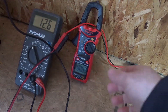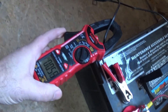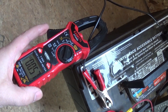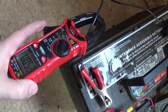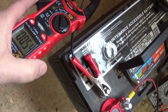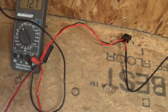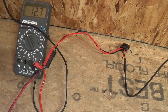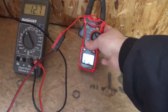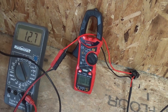I'm going to move the amp meter over to the charger side and we'll see what we're getting from our solar panels. The solar panels are only pulling about half an amp, so obviously we're running at a bit of a deficit and eventually the battery will run out of power. I did try this the other day when it was nice and sunny and I was pulling about three amps from the solar and it was charging the battery. Obviously a sunny day is better, but today's not that day — it's cloudy and snowing.